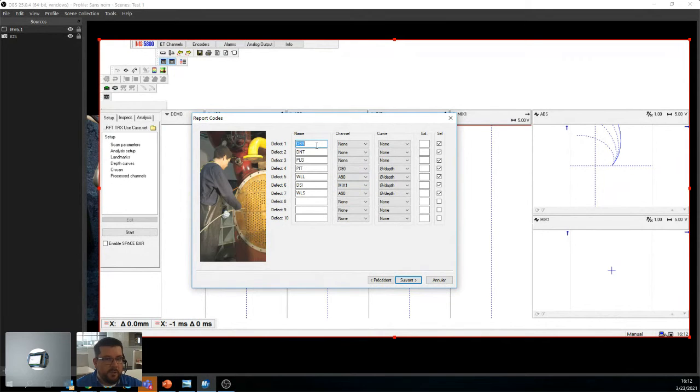So an OBS is an obstruction, which means in tube testing, if you cannot get a full 100% inspection from point A to point B in your tube, forget about it, right? You can't say tube is good, tube is bad. You have to say I was unable to inspect it due to an obstruction, a dent, or it was previously plugged, right? So a plugged tube is, imagine you're in front of the exchanger, and the person before you, or even the inspector before them, realized that there was a tube that was completely finished, so they plugged it up. Either they put a stopper, they welded it shut, whatever, it's plugged. So these are important to identify. Okay, if it's been plugged, it's been plugged. That's all you can say. If you can't inspect it because you hit a dent halfway, you can't inspect it. It's a dent. It's up to the owner to figure out what's going on. And same thing with an obstruction. Okay.